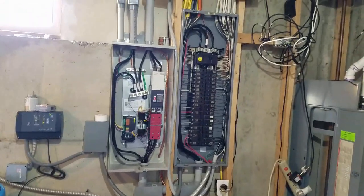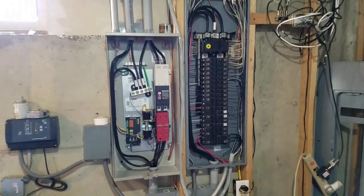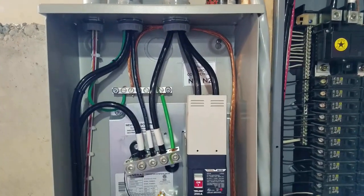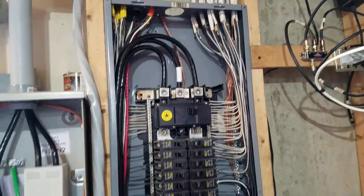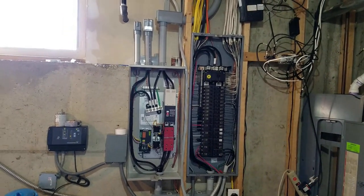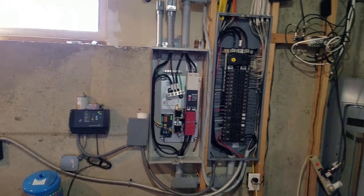March 22nd. Did a final tie-in — had to pull out the mains, put that sweep in to an LB and down, mount the top neutral, come out the bottom, up, and our 22KW Generac generator will be powering the whole house during an outage. I just need to get this all bundled up, get everything closed up, and head outside to do a startup. All nice and closed up, looking pretty good. Now we're going to head outside and attempt a startup.